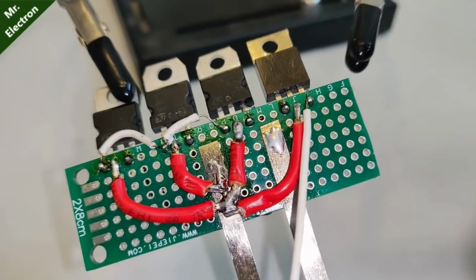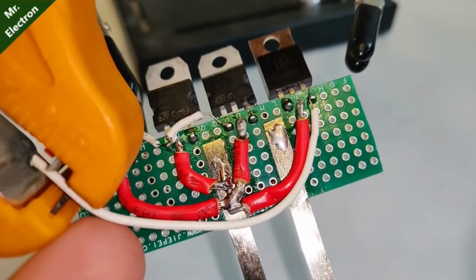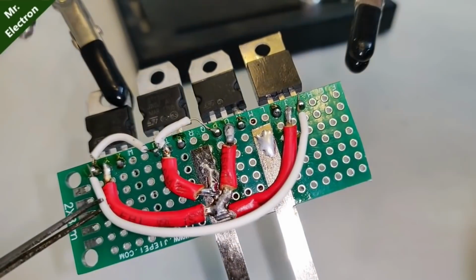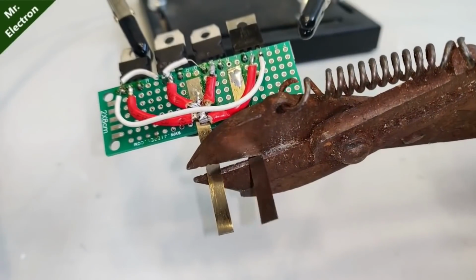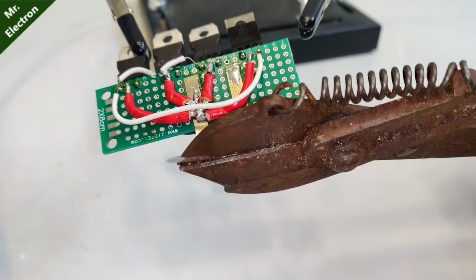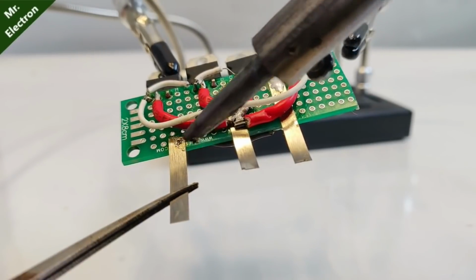After successful connection of the emitter terminal of 1351 transistor to the white wire, which was the common base for 13009 power transistors, cut off the collector and emitter bus bar length, or shorten it up, and with the leftover make another bus bar for the base.